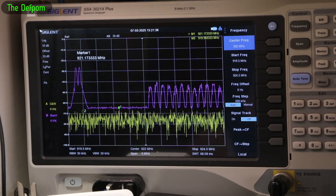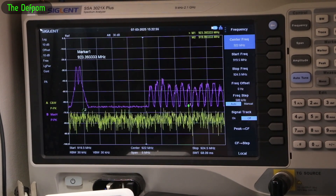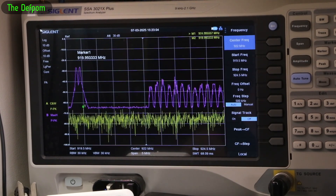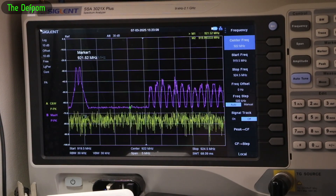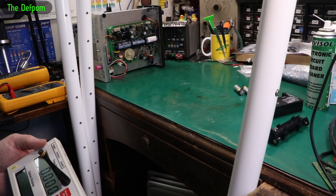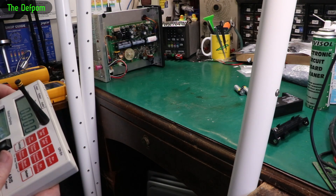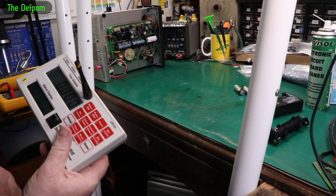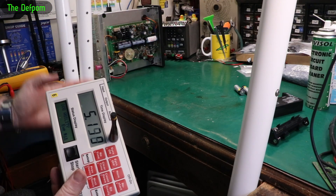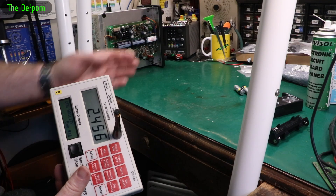The question is: will it keep working? I hope so. I was originally testing at 9 volts; now I'm retesting at 5.3 volts, which this thing considers a low battery. Re-trigger — yep, still working even at low voltage. So the voltage range isn't affecting anything. These are voltage regulated down to 5 volts using LDOs, so even at 5.3 volts it may not have much effect. I've just reprogrammed them to be absolutely sure, in case there was any frequency drift from my cleaning work. The frequency drifted very slightly by about 1 kHz — that's fine. Both poles side by side with one black transmitter pole: starting and stopping is currently working. Brilliant.